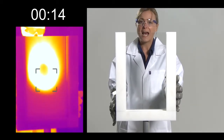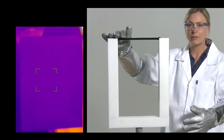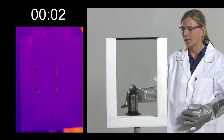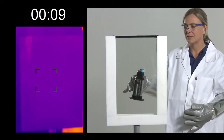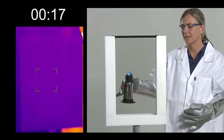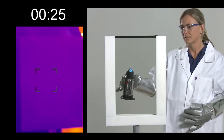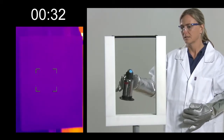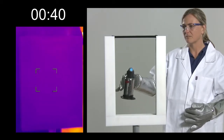So let's try this with double and triple glazing. This is a standard double glazed unit with a gas filled cavity. If I take the blowtorch and start to heat this in exactly the same way, then what we would expect is for it to take a lot longer for the heat to get to the other side of the window. So remember, I'm inside the house. Already I can tell that we'd heated that single pane of glass right the way through by this point.